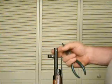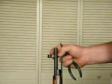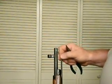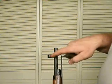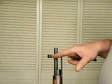To do that, you first have to take the front sight hood off. These sight hoods are dovetailed with a relatively small dovetail. If you look at these sight hoods, as you're looking down the barrel of the rifle from the shooting position, you'll usually see that the right side has been peened or hammered on. That's the side that the arsenal originally installed the front sight hood from.